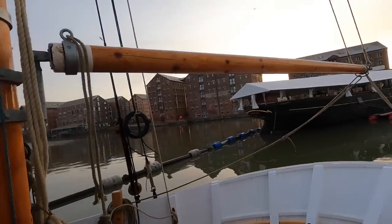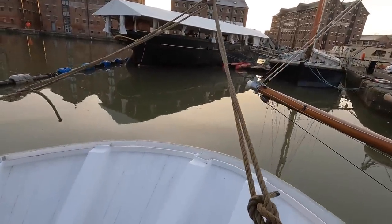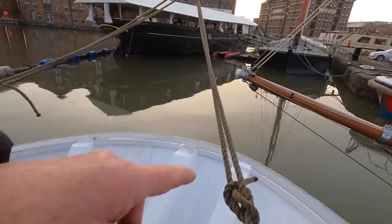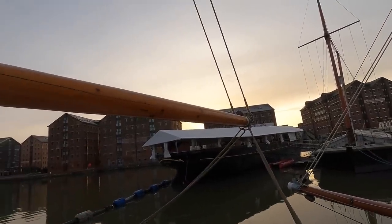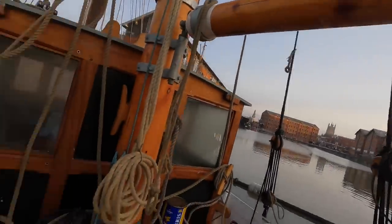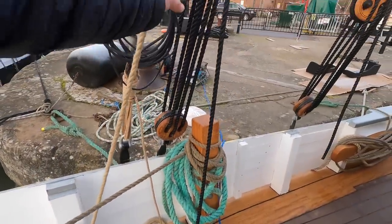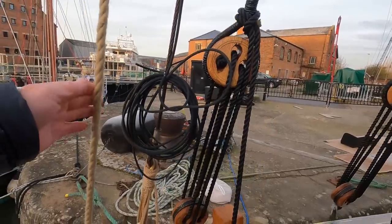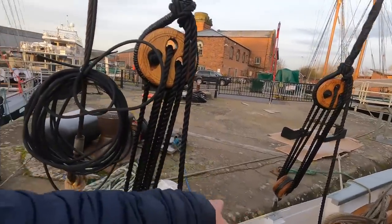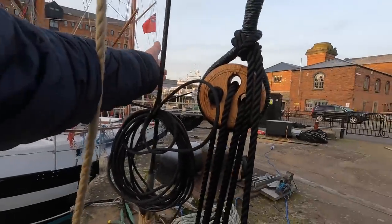And then there's the mizzen here. You can see that I've put the boom on. Because we haven't got a capping rail, I'm in some difficulty regarding cleating the sheets back here. That's by the by. So that's all up and running. We've got that on the topping lifts, which are all working. I've been putting a few cleats on for the topping lifts. That may be modified, because it really ought to be behind the last of the stanchions. As Tommy pointed out, that should be anchored somewhere forward of that, so that when you're running downwind, the boom can come all the way around to that point.